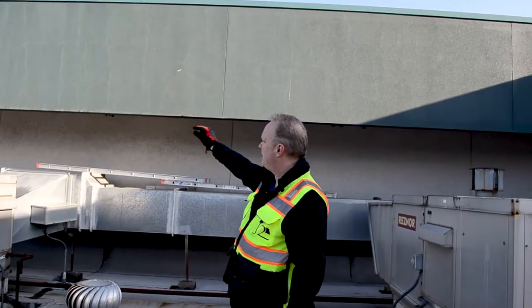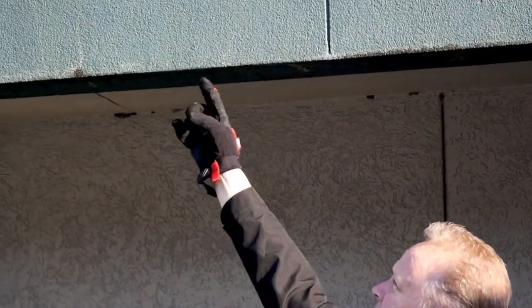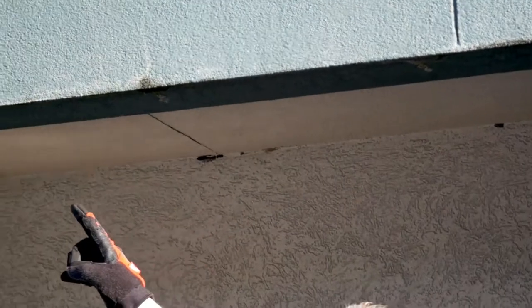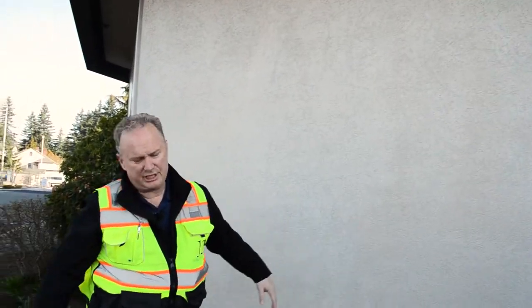All the spider cracking of the stucco is concerning, and you can see staining across the bottom of the stucco panel. Stucco is a drainage system, so water inside it tries to get out and gets stuck at the bottom. There's no drainage strip or weep system, so you can see the water draining off and, looking at the face, you see a lot of spider cracking and staining coming from the bottom of the panel.